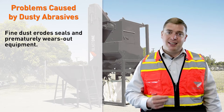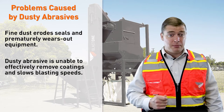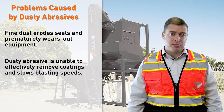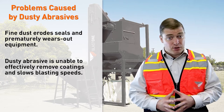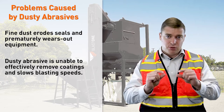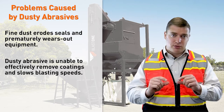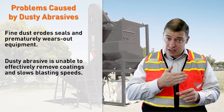The second point is slower blasting speeds. Productivity problems will come if you're using an unclean abrasive, especially if the abrasive is too fine to effectively blast off the coating or contaminants from the surface. One of the key components when selecting an abrasive is to match the particle size to the thickness of the coating you need to remove. Often a blend of particle sizes will be very effective — coarse particles to cut through the coating and finer particles to clean the surface.